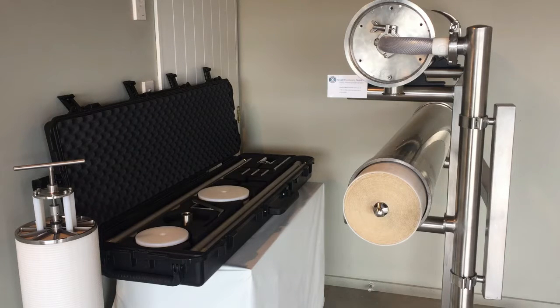You'll see some illustrations shortly which show you how to get the end caps in and out of the membrane pressure vessel, how to safely take ATDs and blank end plugs off, and how to pig out membranes that are really hard to get out.